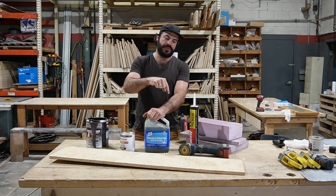And that's gonna set right there. I'm gonna use self-tapping screws to attach it here and then on this side as well. And that gives us a really good place for our foam board to butt up against. And I don't know if you can see this, but it matches up totally flush. And so then when the plywood, our Advantech OSB subfloor, goes down on top of that, we'll be able to screw it right into here. So on this edge and the leading edge, it has a nice solid bite and good adhesion. And we're not just relying on the glue to hold that edge in place.